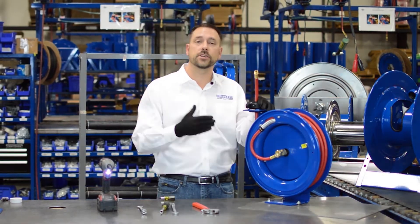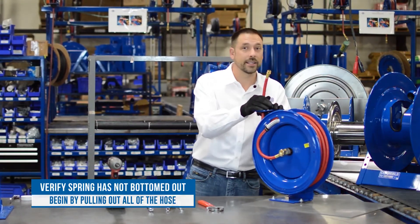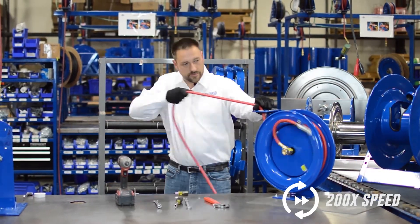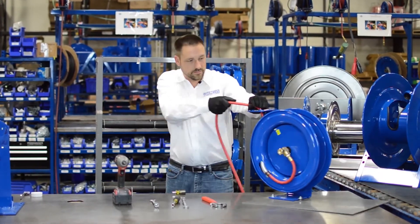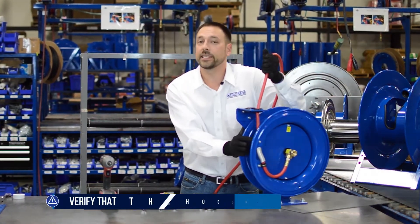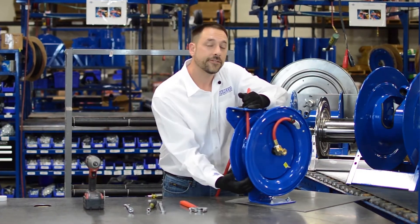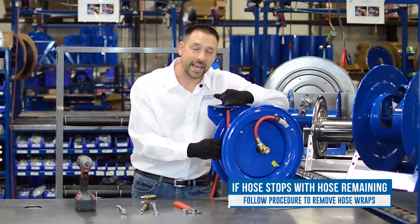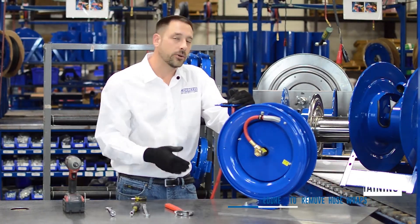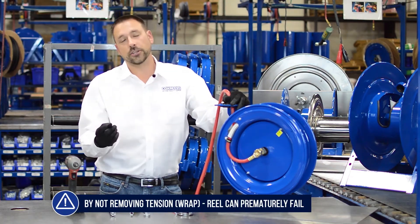The reason I don't prefer the post-tension method is that there's an extra step: you have to check to make sure you have not bottomed out the spring with this installation. To do this, wind all of the hose off and look at what's stopping you at the end. What you want is the hose strap stopping you. If the spring stops you and there's still hose left on the drum, you'll get premature spring failure — you'll need to remove a wrap. We have an extra video for adding and removing tension on our YouTube channel.